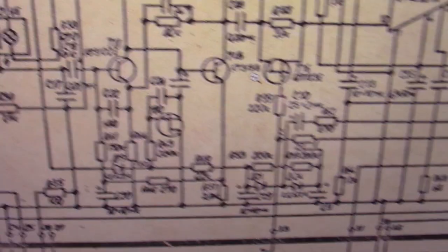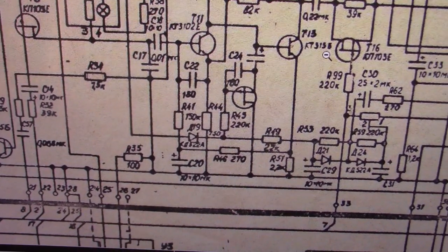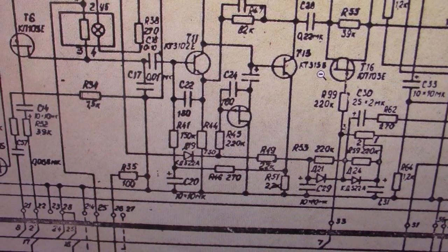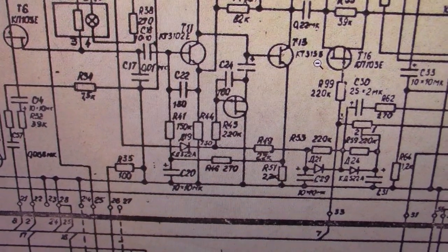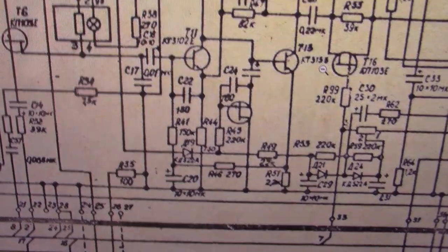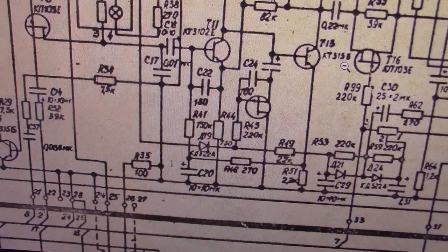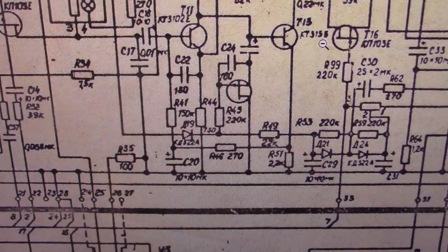When I put a 220K in there, I got a tiny bit of ALC operation. I would yell into the microphone if I had something in the background while I was recording as a reference, and once I was finished yelling, I could notice the background sound was a little bit lower level, then it would quickly go back up to full sensitivity. But it was very slight ALC, hardly any at all, and it was still overdriving like mad. So it wasn't giving me much ALC.